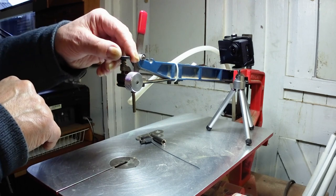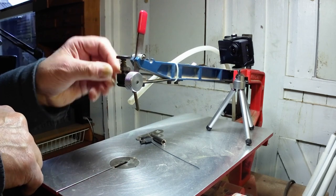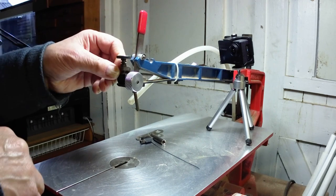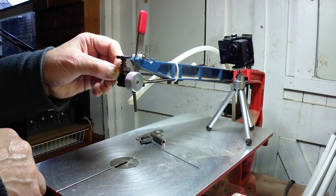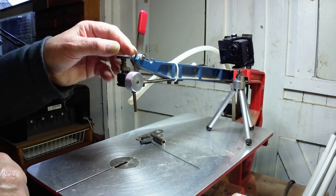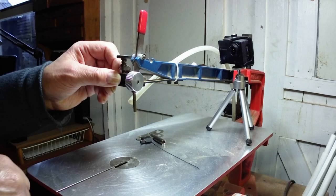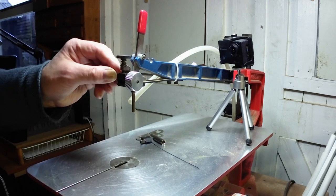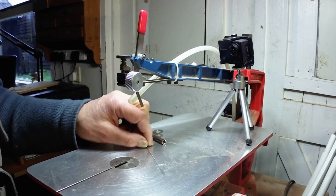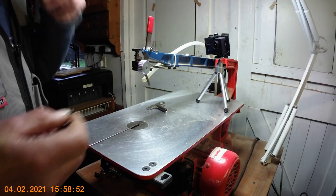According to Hegner, you're supposed to tighten it down so it's tight — there's a little recess in the top of the clamp where the end of the bolt fits and holds it. What I do is not tighten it completely — I just have it so the clamp can rock slightly as it's meant to do, but at the same time it won't fall out.